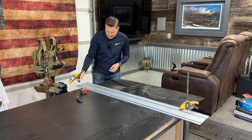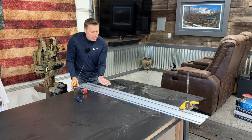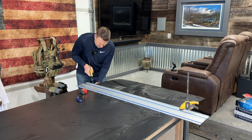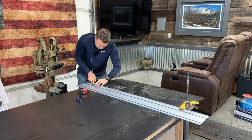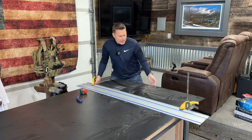One thing to be courteous of is your surface underneath. If you're doing this on a larger table with a nice tabletop, be careful that as you're driving over the opposite end, you don't pop off and mess up that surface. You're not exactly trying to cut all the way through — you're just giving it a scoring. Now that's created a weak point. What I'm going to do is support that side, just on the side of that line I just created, to give it some support as I bring it up and snap it.